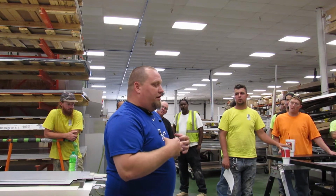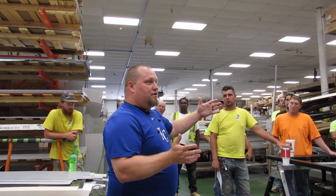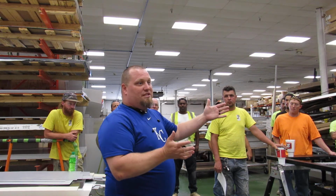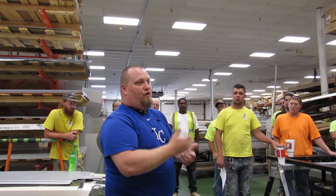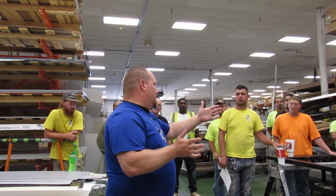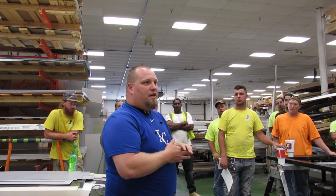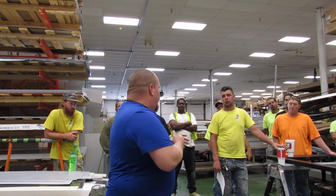As project managers on our side, some of the things we need to do is, if we get a much larger sill flashing, we need to look at using thicker metal. If you guys see that when you're putting this stuff in, mention something to us about that, help us out, because sometimes when we see it on paper, we're just so used to doing 040. Once we get above a certain point, we need to probably be using 063. It does cost a little more, but not enough to have to worry about going back and replacing it later. That's a judgment call we can make. Same with corners, things like that.